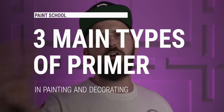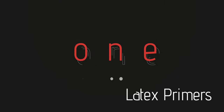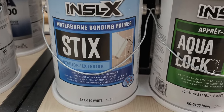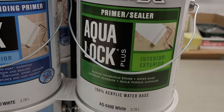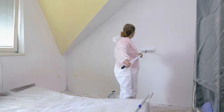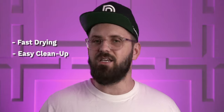There are three major categories of paint primers that exist, and within those broad categories you will have a ton of different product options depending on what you're painting. The first one is latex primers. Water-based primers are quite possibly some of the more popular all-purpose primers that exist today. Because they're not chemically rigid like some of the other primers out there, they tend to be less susceptible to cracking due to their flexible nature. Latex primers are a very popular choice for drywall and soft woods, and they also have the added benefit of being fast drying and very easy to clean and deal with.